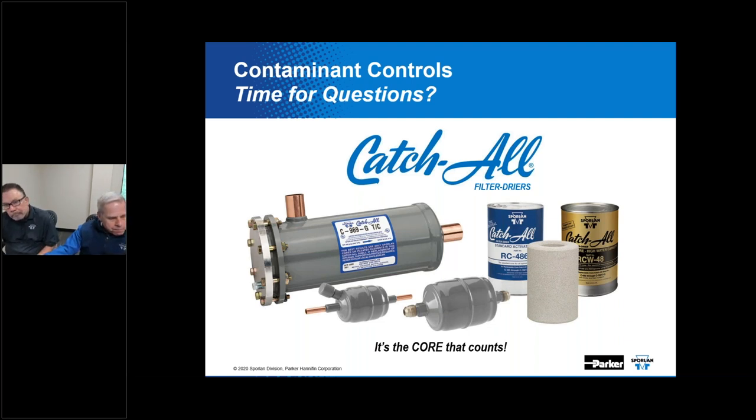If a refrigerant line breaks and the system is exposed to high humidity conditions for 24 hours plus, can you rely on the filter to remove the moisture in the POE oil? Well, I think that goes back to that slide where we had the reasons to replace the filter dryer. You've had a catastrophic leak and the system's been open for a period of time. I mean, in this particular question, he said 24 hours.